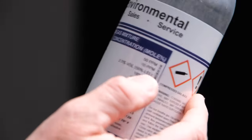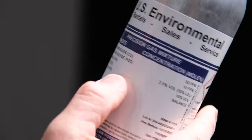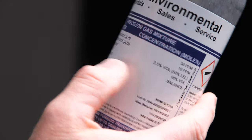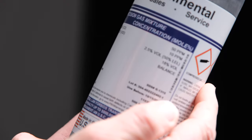The canister also needs to have the correct gas mixture: CO at 50 ppm, hydrogen sulfide at 10 ppm, your LEL measured with methane at 50% LEL, and oxygen level at 18% by volume with nitrogen balance.